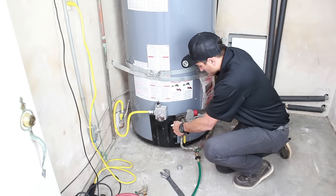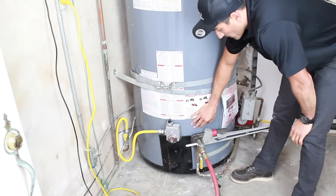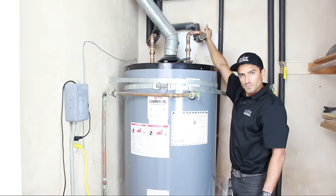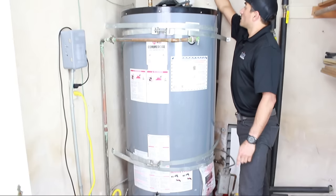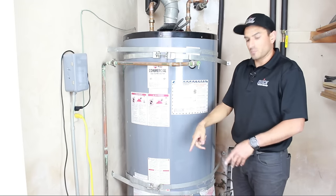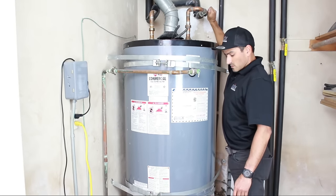I can tell we're pretty much there. I don't want to do it too tight and get it stuck permanently — just replace the small hole with the bigger one. We've still got all the sediment mostly trapped in the bottom of the water heater, so I want to pump the valve up top. We'll go to the top of the water heater, find this valve, and open it. Then open this valve at the bottom and repeat this process a few times — shooting water into the bottom, stirring it all up, and then releasing it through this main valve.